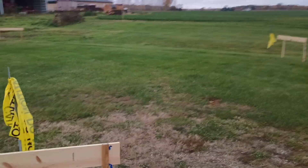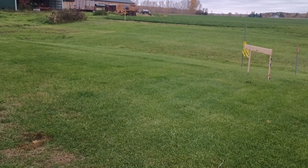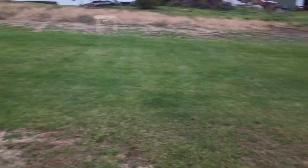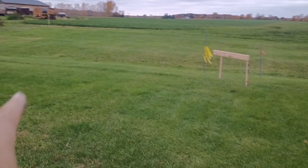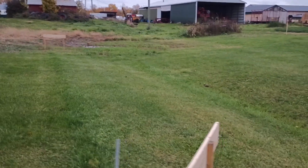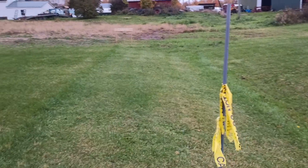I've got about a foot and a half fall with my grade. For now I'm going to keep the sod in place because it's been raining for a week and we're expecting rain next week — so we'll keep the equipment on the grass and get the poles all set. Once I get the poles set, squared up, screwed together, and locked in place, we'll take the bucket of the skid loader, drag the topsoil off, drag in the slag, drag in the stone, set up the transit, and get the inside all leveled off. I've got a natural fall — we built a ditch back here about 15 years ago to help keep the water out of that field so we don't end up with mosquitoes in a big wet area. I've got enough room on the back to get scaffold set up, run the lawn mower along the side, and pretty much stay away from the ditch, though the ground is going to be kind of mushy over here.